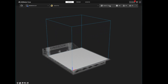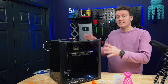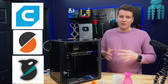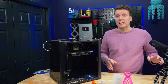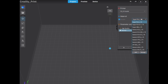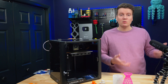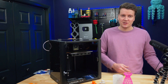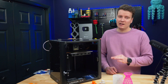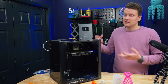Another reason this would only be good for a real tinkerer is that it only comes with slicer profiles for PLA filament. It does come with profiles for Cura, PrusaSlicer, and OrcaSlicer, so that covers your bases, but each only has a preset for PLA. It's really common nowadays for most printers to come with good profiles for all compatible filaments. This one only comes with PLA, and I think even that could be optimized a good amount. So if you want to print TPU, ABS, or PETG, you're going to need to work on those yourself.